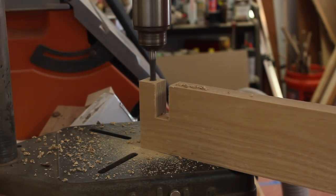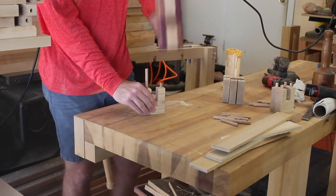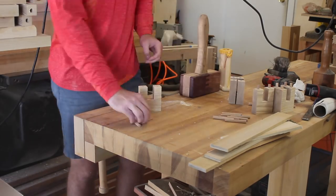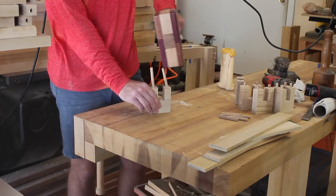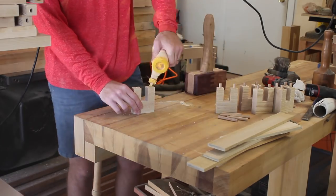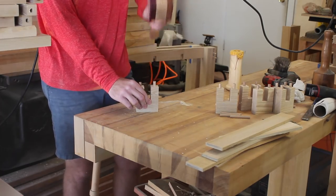These little ones here are brackets that are going to go on the short sides, and it's just going to be a faux brace just to continue the look on each side. But I'm just hitting some dowels through to reinforce the pieces and I'll come back and trim them later.